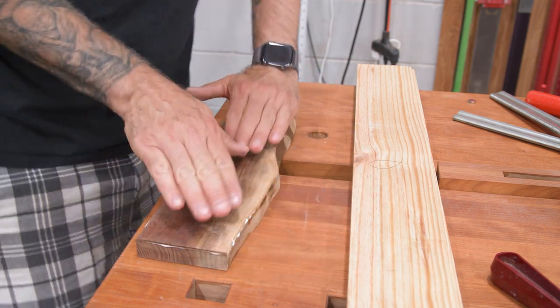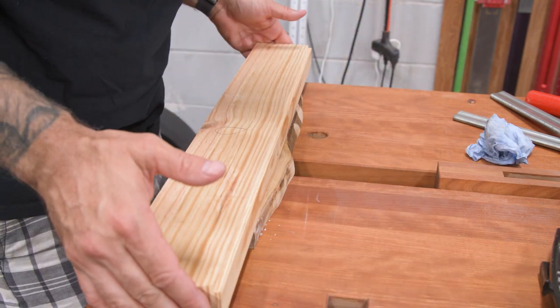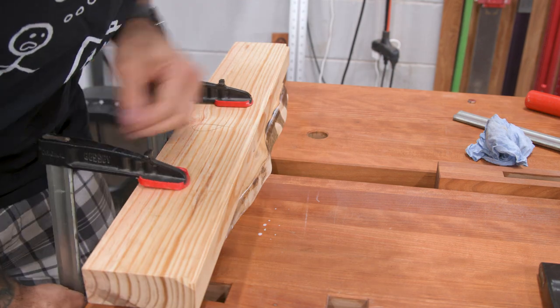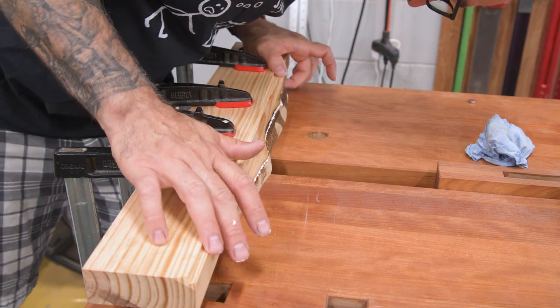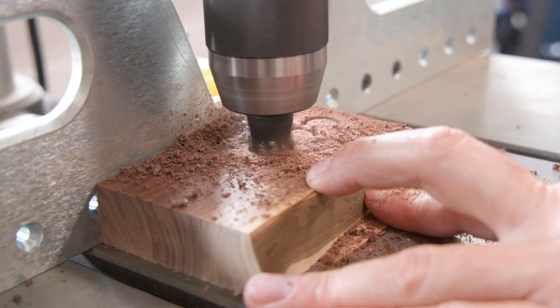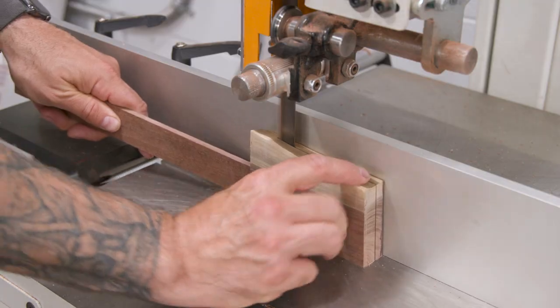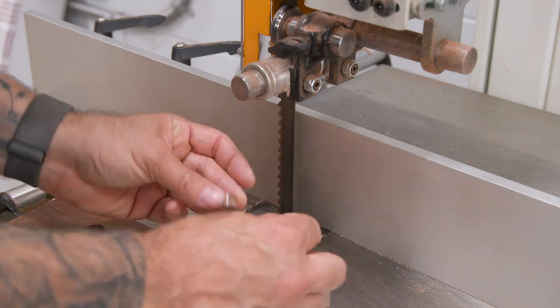With the glue applied, the top veneer is gonna shift around a lot, so I take my time adding clamps and a caul, making sure the live edge is smooth and any offset ends up at the bottom of the board. We can clean that up later. Originally, I thought I'd be attaching this thing to the wall with screws, so I used one of the offcut pieces to cut some plugs. I didn't wind up doing that, but here's some footage of me making plugs anyway.